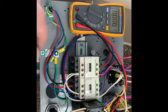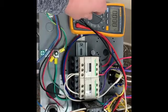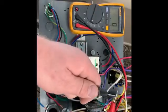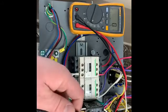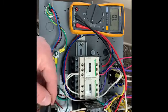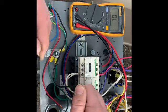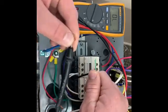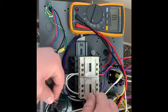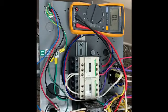What I like to do first is test the motor by pulling out the leads — I've already loosened them up — then set your meter to ohms. Generally with the tone function you can hear it: if you get a tone, that means there is zero resistance. When you ohm out the motor between each phase, there should be a tone indicating some resistance between the windings. If you do not get that, it means you have an open winding and the motor needs to be replaced.